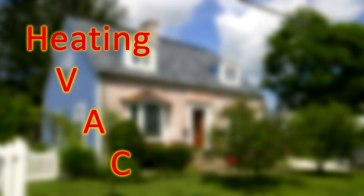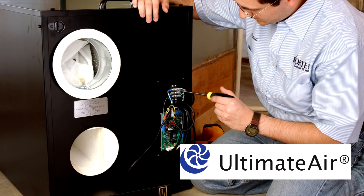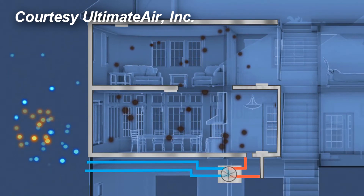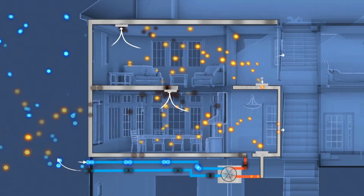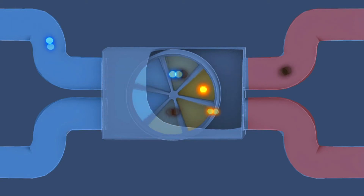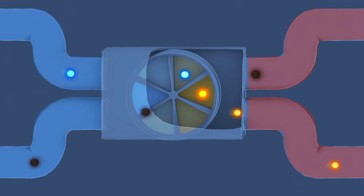Fixing that requires taking a closer look at our HVAC. Most folks know about the heating and air conditioning part, but don't think much about the V, which stands for ventilation. The best practice for properly ventilating a home is to use an energy recovery ventilator, or ERV. At our little blue house, we chose the best ERV on the market — the Ultimate Air Recuperator. Its computer-controlled fans constantly exhaust stale, contaminated air while bringing in fresh outdoor air, keeping air fresh inside at all times. At the same time, the recuperator passes both outgoing and incoming air through an energy recovery medium, absorbing heating or cooling energy from the outgoing air and passing 95% of that energy into the incoming air — giving our house all the fresh air of an open window with 95% less energy loss.